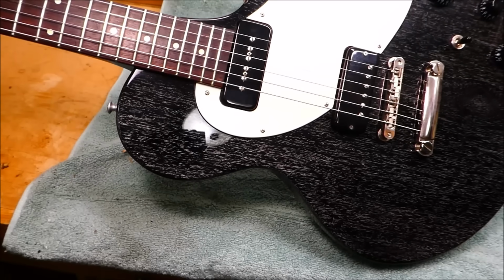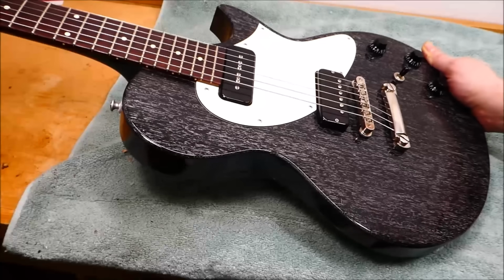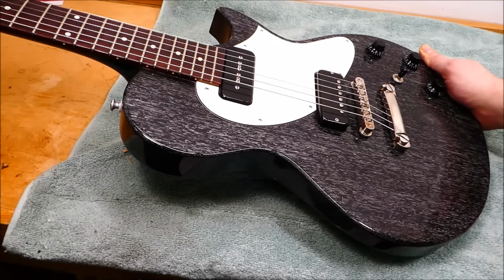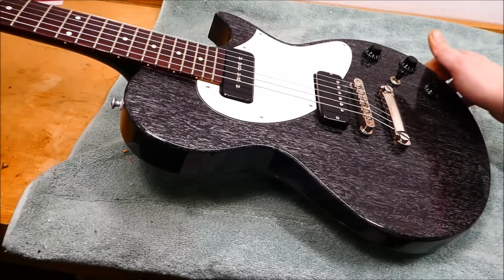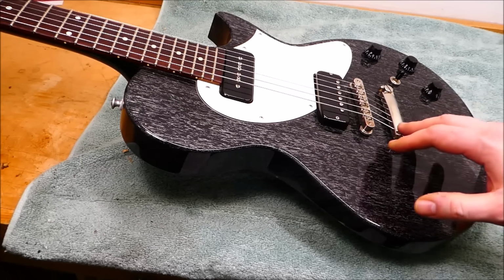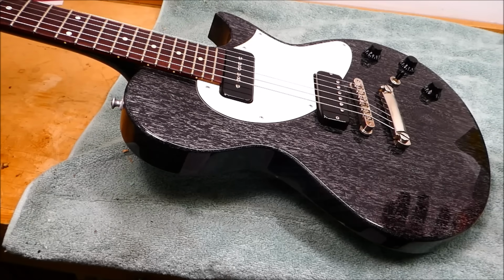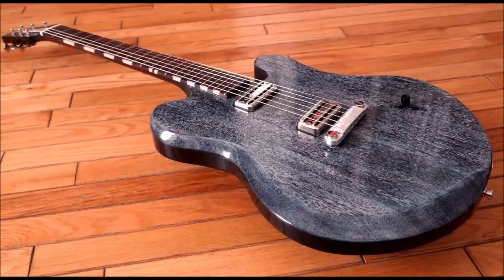Not that easy to do effectively, I learned. I tried it a few years ago for Alfie Smith's guitar, and I used a water-based top coat material and found that the white I used to fill the pores wanted to migrate up into the clear layers, and it ended up more gray and ghostly looking.